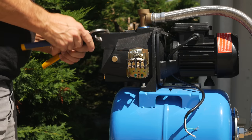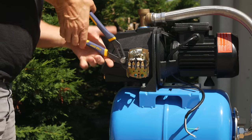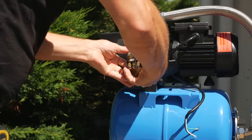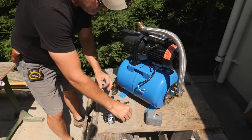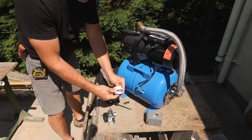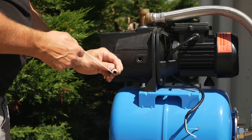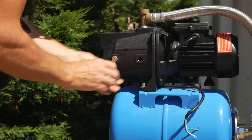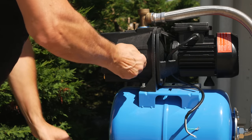I'll disconnect the wires then spin the switch to remove it from the pump housing. I'll need to add a short nipple as the new switch didn't come with one. Since this is a seasonal pump setup I opted to wire a 110-volt plug to the pump so I can just plug it into a receptacle in the shed when I need it.